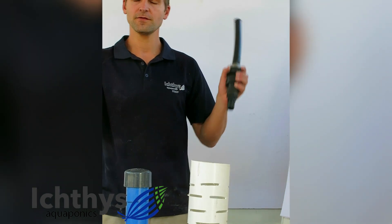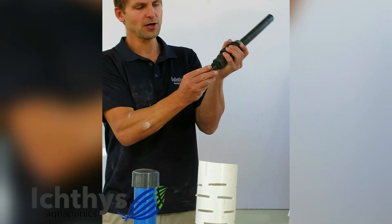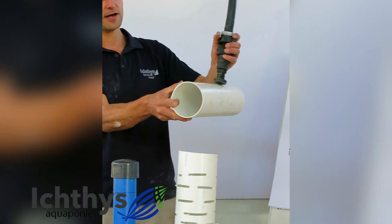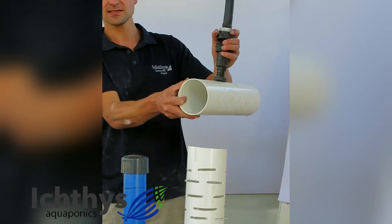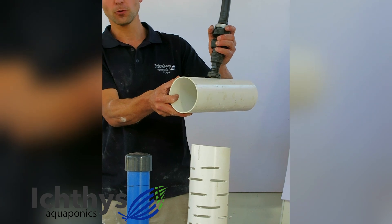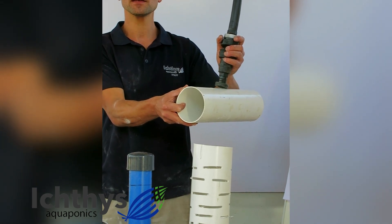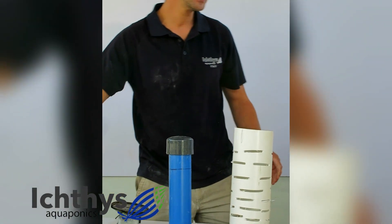To make sure it's airtight, I've got my female connector and a 25mm grommet, which I'll put over that connector. I want to cut a hole into the 110mm pipe and push it in so it's an airtight, watertight seal. When it drains and there is a lot of water draining into the pipe with other gravel bits, it won't overflow at this point.